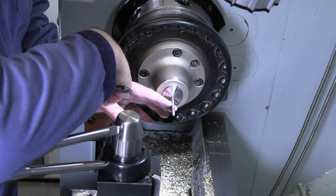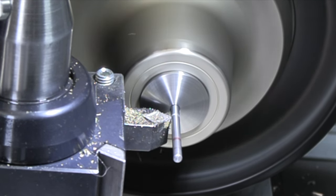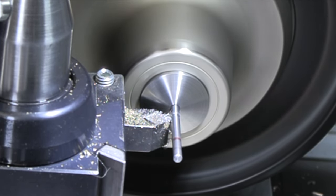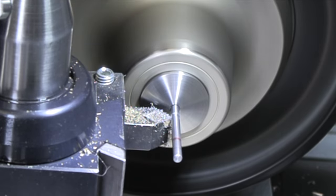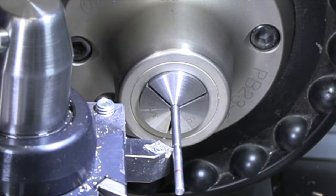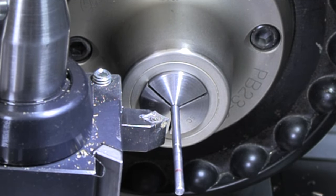All right, I'm gonna go ahead and put the grooves in this shaft so that that is done. I just went 30 thou deep, 40 thou wide. Enough room for those set screws to bite in there. Okay, there's the middle of that groove. So I'm gonna come out, go 1.063, and repeat that same groove, 30 thou deep, 40 thou wide.